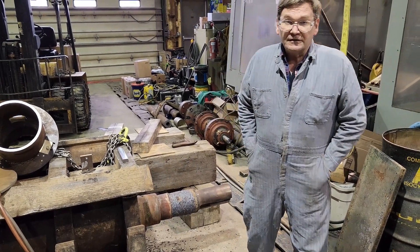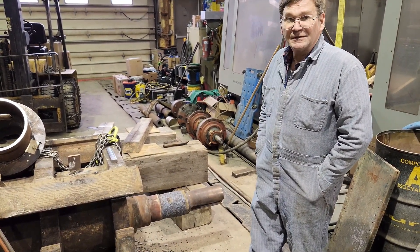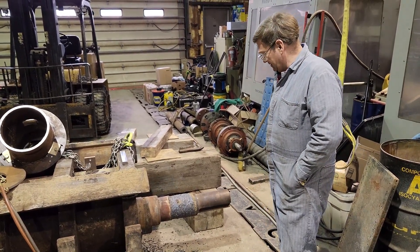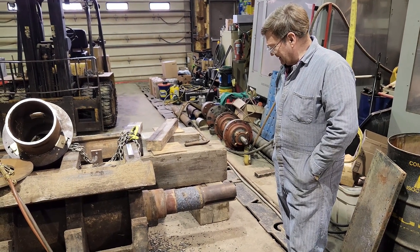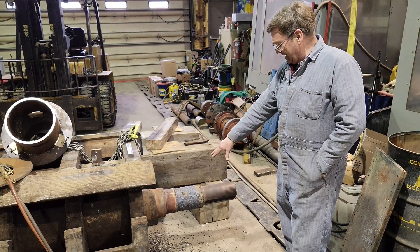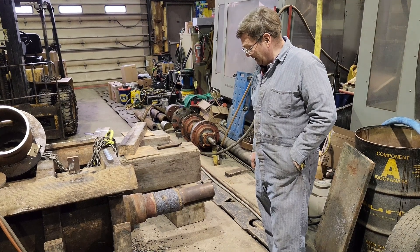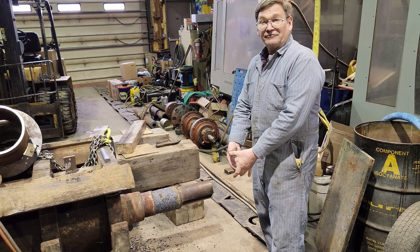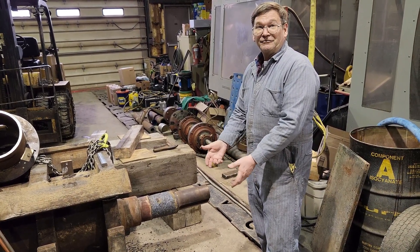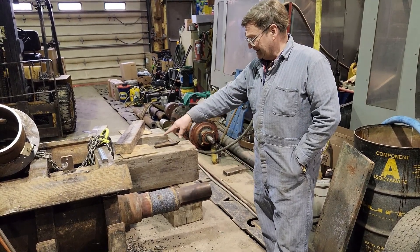This is the same diameter as that one, so this is the one we'd use for our rollers to run straight instead of on an angle. Just looking at it, I do believe it is bent — but I want to know how much, so we know how much to pull it which way. Whether it bent before we welded it or after is kind of irrelevant. Since it had been narrowed down to a very small section of shaft that was hot when this quit being used — because the bearing had melted into it — it may have gotten bent just from operation as it was dying.